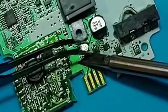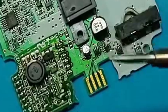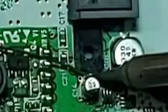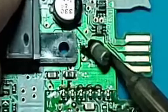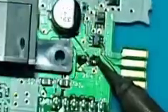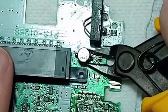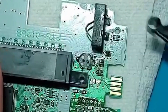There are two ways to remove capacitors. The stupid way is to gently rock the cap back and forth while applying heat with your soldering iron. This can cause the pad to lift and destroy the whole board. If you do insist on being a dumbass, make sure to apply lots of flux and introduce fresh solder often, you moron. Against all odds, you've managed to not bung it up with your low IQ efforts. Congratulations, dum-dum. Now clean up the mess you've left behind.